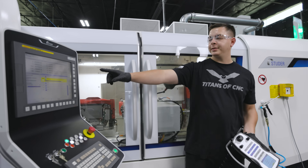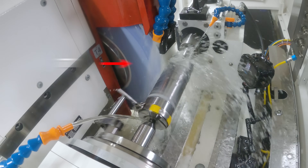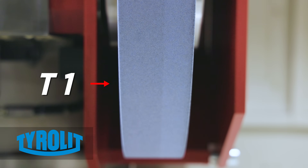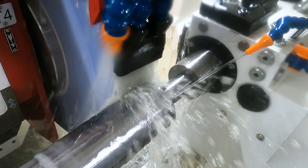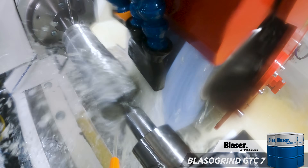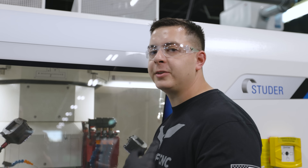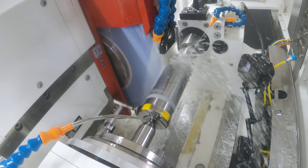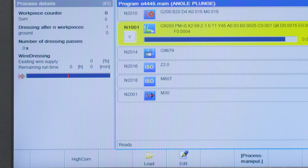As you can see, X and Z are both moving — it's vector grinding down. Since we're cutting with tool reference position one, we're cutting with the left side. If we were using tool reference position eleven, it would vector grind to the right side. The coolant lines are putting oil right on those centers, keeping them lubricated and cool. What you want to listen for is excessive ringing — you want to check your part, make sure it's not burning, chattering. That's why I stand pretty close to the machine — I can hear the ring, which is actually what the Sensitron does: it picks up the ringing from the grinding of the part on the wheel.